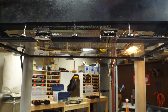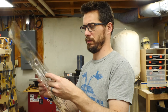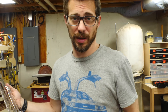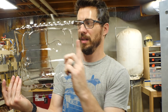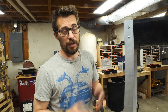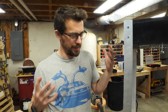I also went back and adjusted the height of each one of the magnets making sure that they were the same distance from the top. So this is the first test — we used plexiglass because it was the only thing we had in the right size, and it's a really brittle plastic. ABS or styrene will work a lot better and I'm actually waiting on that stuff to show up so we can do a proper test. The heating element is only about half the full width of this thing, and you can actually see it — it heated up in this section and not at all on the sides. This is not a big deal, but you're just going to have to work within the heated area, so I can't do something that's actually 24 inches long — I'm stuck with about maybe 8 or 10 inches in the middle. The only piece of styrene that I do have is actually too small — it's 12 inches square — and there's nothing supporting the sides of it so it's probably going to droop all weird, but I just want to try it.